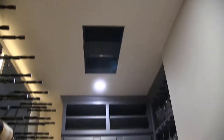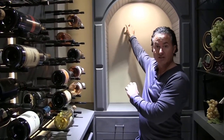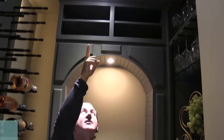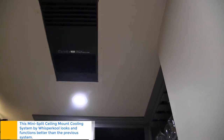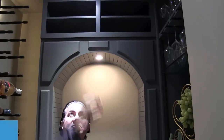They had a self-contained unit — one unit that goes inside and exhausts to the outside — but that's not the best unit for this space. Aesthetically, you don't want to see that either. We ran a Whisper Cool ceiling-mount unit up on top, which is a split system: the condensing unit is right behind this wall and the ceiling unit is right up on top.